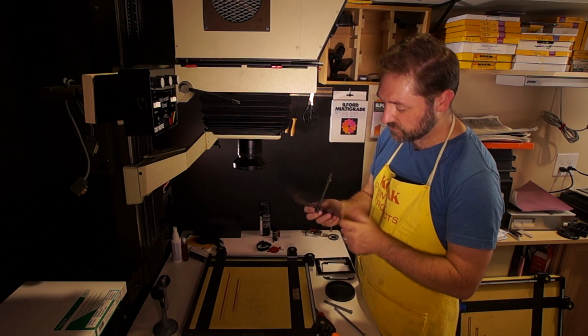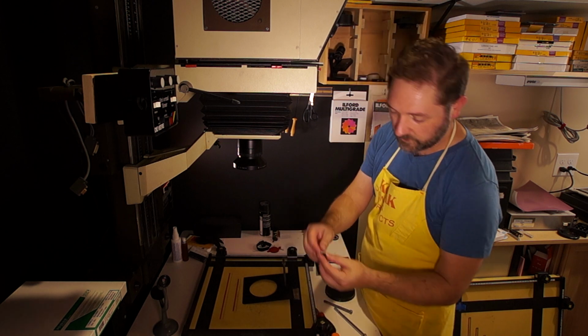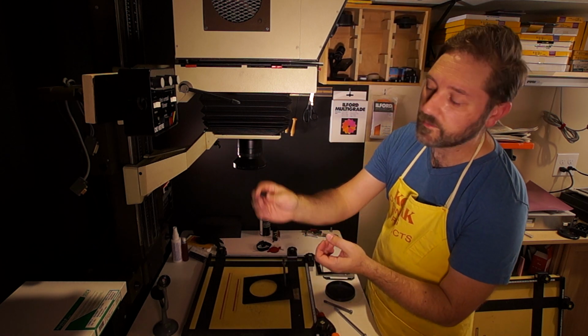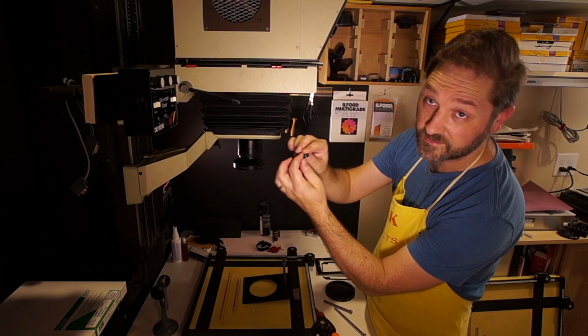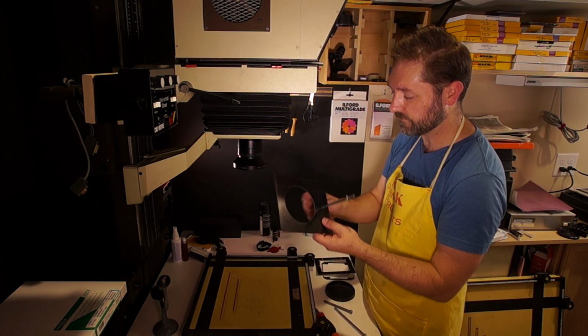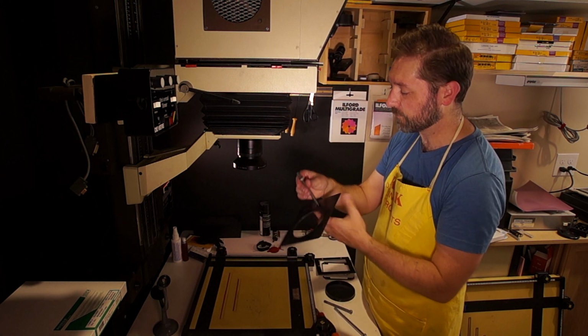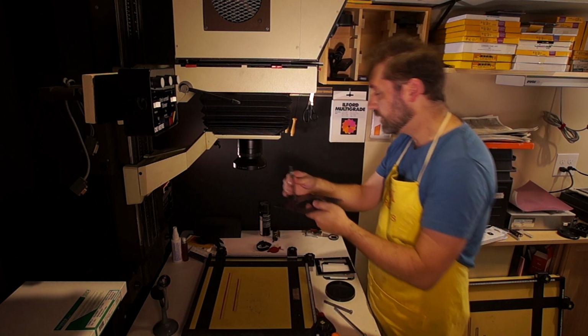And then the way I attach it is pretty simple. I just put a hole in the sheet, and then I've got one of these little gaskets that has a groove in it around here that's a 1/16 of an inch thick. So I pushed it into the hole in the Garolite, the phenolic resin, and then the bolt up through it. So now I've got a nut here that I can use to tighten up against the enlarger.